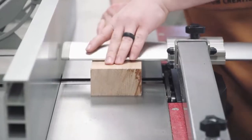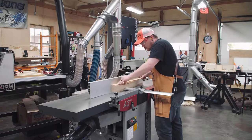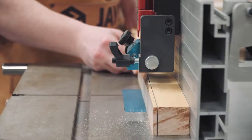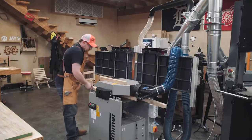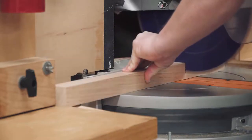The majority of the work will be done with the ambrosia maple, so that's where I'll start. First joining one wide face and then both adjacent narrow faces, then it's over to the bandsaw to rip the blanks into about one and five-eighths of an inch square, and then back to the planer to establish a one and a half inch thickness in both directions. At the miter saw a fresh 90-degree end is established and then the legs are cut to their final length.